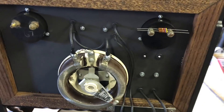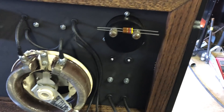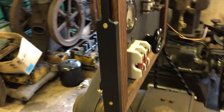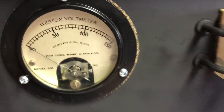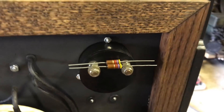The only other thing I need to do back here, after the load wiring, is the voltage sensing for the voltmeter. And what I forgot to mention in the previous video — this ammeter, let me show you the front — it actually says right on the face it must be used with an external resistor. It's a good thing I remembered to look at that.